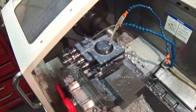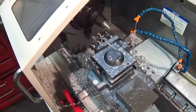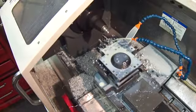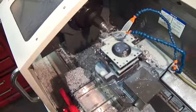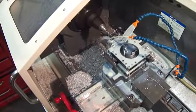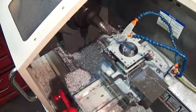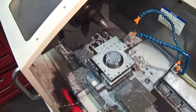This setup is running on a Royal 5C pneumatic collet closer that has been wired directly to the Haas control through a solenoid. It runs unattended short of loading up a new piece of bar stock when needed. M51 closes the collet and M61 opens it. This job is using a sub program with a loop count to agree with the bar stock length.